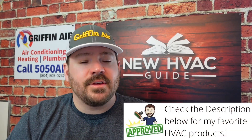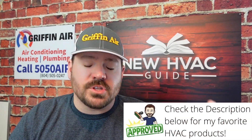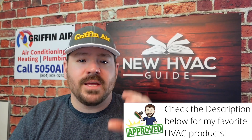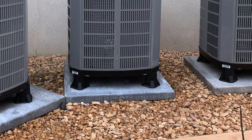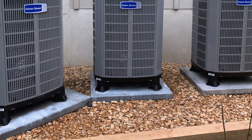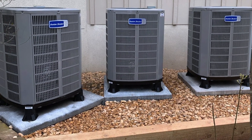And of course in commercial buildings we see rooftop units all the time. Another thing to consider is if you live in a cold environment, maybe a more northern state where you see more snow, you might consider elevating the system because of snow or other inclement weather. You want to get that system even just a few inches off the ground. We see things like snow legs or pump-ups — depending on the brand, they have different names — but they're basically plastic legs installed under the unit to elevate it.